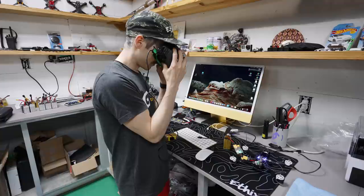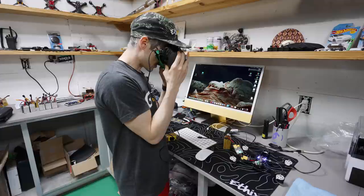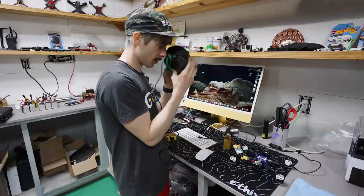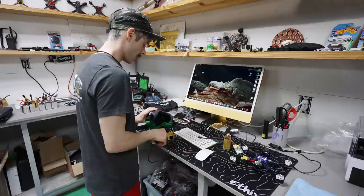And then device, I'm gonna go in here and I'm gonna turn max power. I have 1200 milliwatt unlocked, but I'll just leave it at 700. And then auto temp control, I'll just leave that on. As far as OSD inside here, I have telemetry for RSSI, I have milliamp consumption, and I have amp draw, I have battery voltage, I also have time flown, and obviously goggle voltage as well. So we are all set to go.